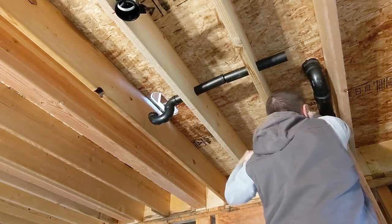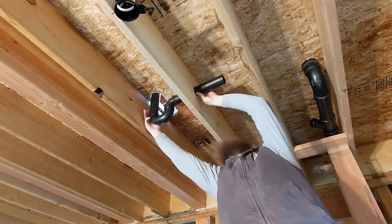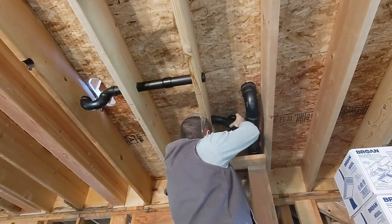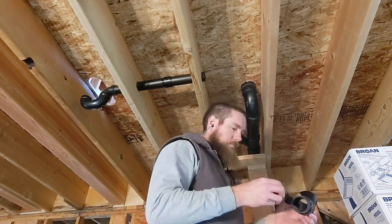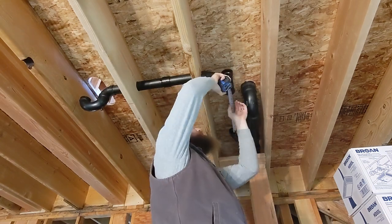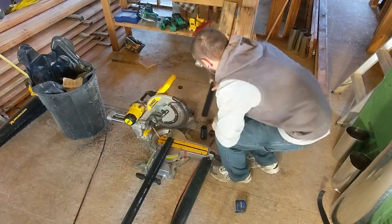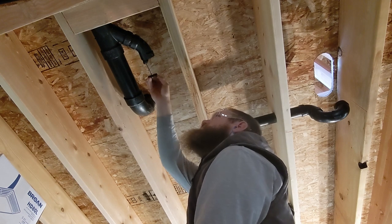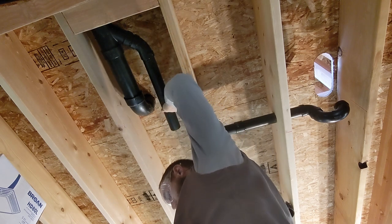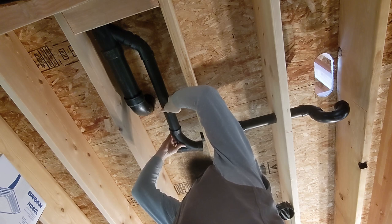In the last house we owned, the kitchen was on one side of the house and 30-plus feet away was all of the rest of the drainage lines. The kitchen went all the way over in one and a half inch pipe with maybe a sixteenth or thirty-second inch slope to the main bathroom. Naturally it plugged up completely in the two years we owned the house, and I almost had to replace it when I couldn't get it unclogged. Turned out to be years and years of built-up grease that filled the entire pipe. A real plumber managed to get it cleared — we'd been using scalding hot water and Drano to try and clear it. He explained we probably had just temporarily decongealed the mass, and when it re-solidified it plugged what little pipe hadn't been blocked. Better for the pipes, the blockage, and our septic system to use a biological agent to eat away the organic material — biology is how your septic tank can go so long without pumping, after all. And that experience is a constant reminder for me to do my best on this build.